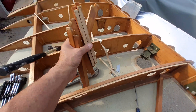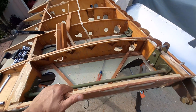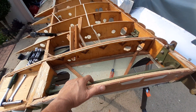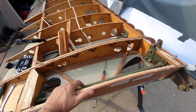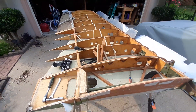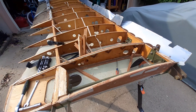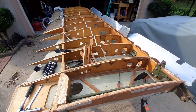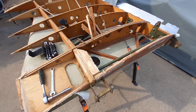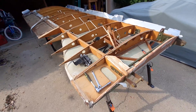Yes, it's 50-year-old glue, but this type of glue requires everything to be perfect — no gaps, humidity has to be just right, temperature can't be below 70 degrees when you apply it. The FAA doesn't even recognize this glue anymore as a certified woodworking aircraft glue, so I'm glad I'm rebuilding the whole plane.